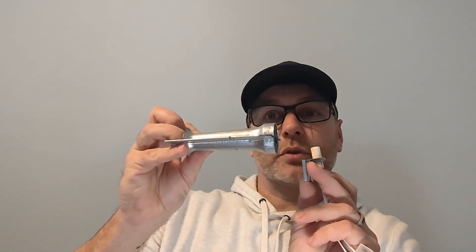Let's say you've got four burners in there. That igniter only sits in front of the first burner, so it lights the first burner and now that flame is supposed to travel down to the next one. But if you've got a big chunk of rust or whatever obstructing that channel, it lights the first burner, lights the next burner, and then all of a sudden can't get to the third one. Now you've got two burners that are not burning - they're just putting gas out. A lot of times you get delayed ignition where it's loud and kind of scary for people.